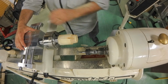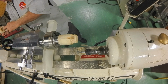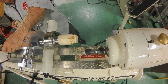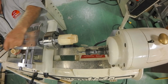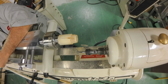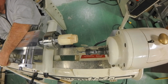So the little tenon on your rail, that part there, yeah? Yep. You initially said that just has to fit in. That just fits in the thread, yeah. Okay, so that second tenon, is there a dimension that diameter has to be? No, it can be anything. Anything larger than, well, I guess really there is, but I don't know what it is. Dave, you might be able to answer that: what the depth of the thread is from the root of the thread to the top. It's going to be whatever you make that one, right? Right, yeah. So it can be quite a bit larger, and all you're going to be doing is more cuts to bring it down.